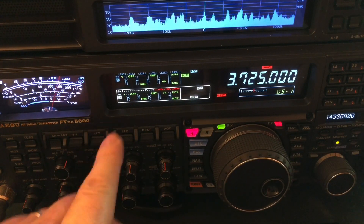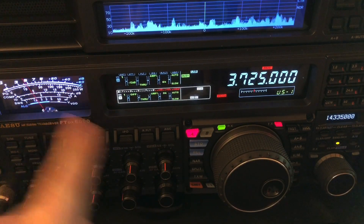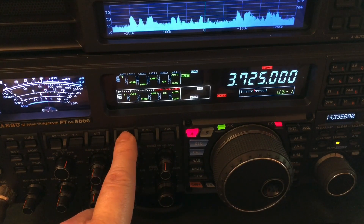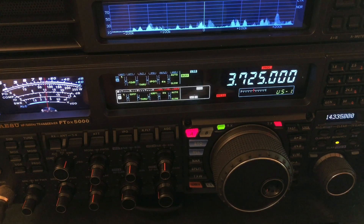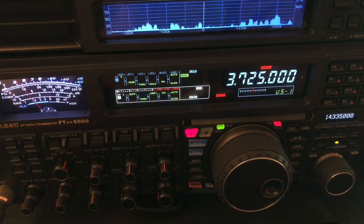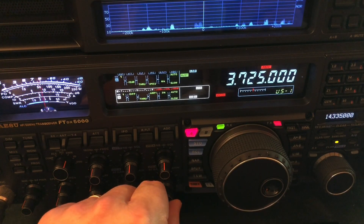So the first thing I'm going to do is attack that coming in from the antenna. I'll engage 6 dB of pad — you see it dropped a little bit. Maybe even 12 dB of pad. The idea is, as long as I can hear them, that S meter can rest on zero. Now I'm going to turn off the RF preamplifier because I don't need an amplifier pulling in even more noise when their signals are so strong — I'm going to go to IPO1. Now let's look at the noise floor. It's getting rather quiet. I'll go ahead and engage IPO2. Listen to that — it's almost like being on a repeater.